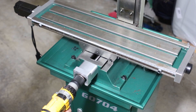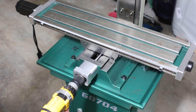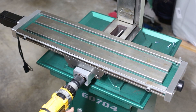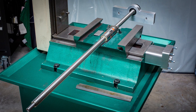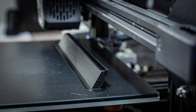The last step is to check the travel, just like I did on the z-axis. Using the shaft coupler to drill adapter that I 3D printed, I set the clutch on my cordless drill to a very light level — in this case number three — and then run the axis through its range of motion and verify that there's no sticking or binding. And that completes the installation of the y-axis ball screw assembly. I do plan on making a video in the future of milling out the clearance slot in the saddle for the ball nut. In the next video, number seven, I'll be installing the x-axis ball screw assembly and table. Oh yeah, and 3D printing a gib for the x-axis just to see if it'll work. Subscribe if you want to follow along.